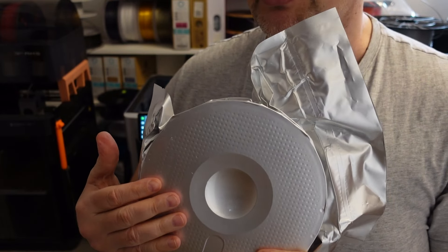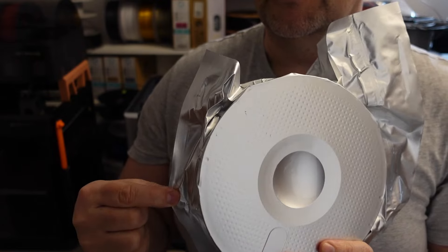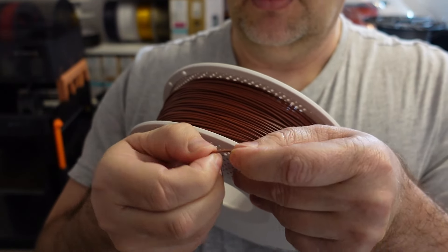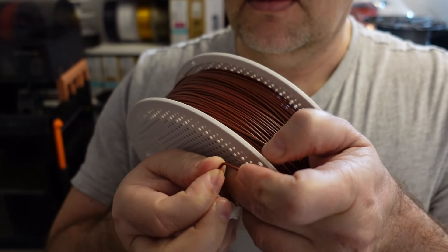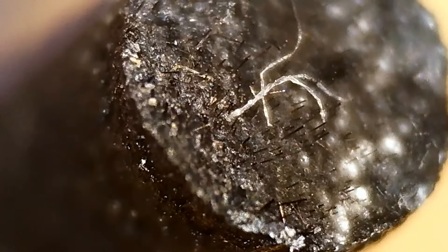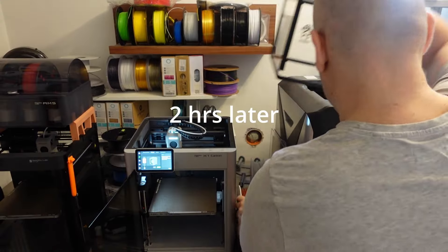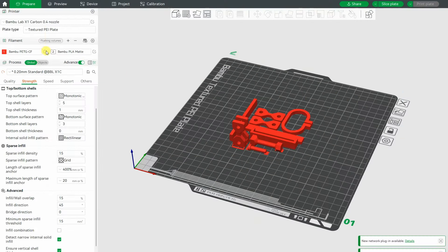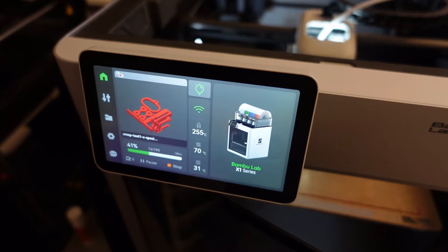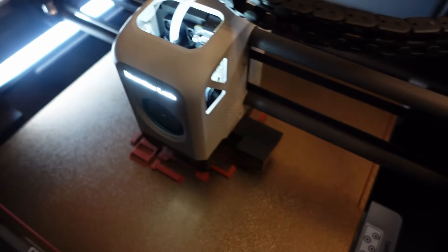Now I will start drying the carbon fiber version — don't forget this bag is resealable on the smaller side. Interesting red color. I immediately want to check how brittle this material is — it is quite brittle, like PLA. Under the microscope we can see the base material in red color and the carbon fibers are of course black. For comparison, the carbon fiber PLA is black as the base. The default settings in Bambu Studio are 255 print temperature, 70 on the texture bed, and 11.5 maximum flow rate. At 40% through the print, even the critical bridging is printed well — the carbon fibers really help the printability of this material.